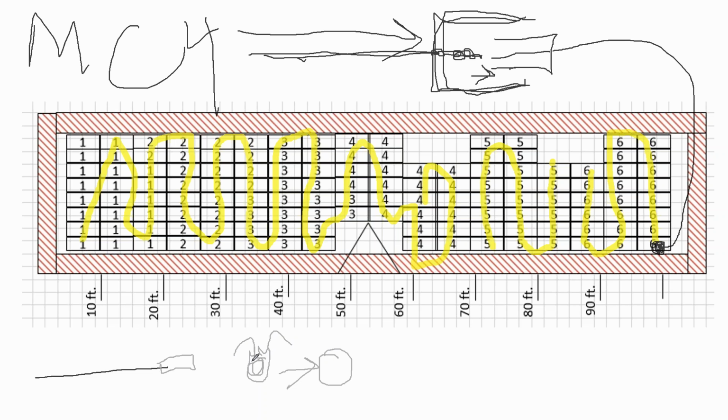And sometimes these U-shapes, especially if you're using the cheaper $40 crimp tools that you can get off of Amazon instead of the $500 crimp tools that you would use as a listed tool on a commercial or industrial project, that crimp might not make. And then the housing connector is really bad.